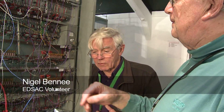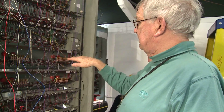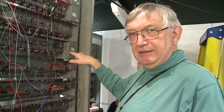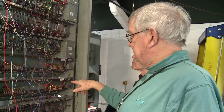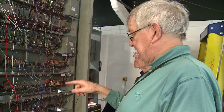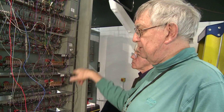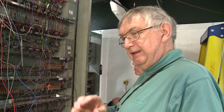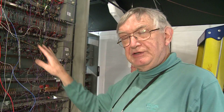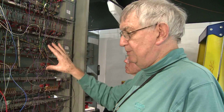This is a solution to a problem that's been going on for a while and it's now working really well. In this rack there's a storage unit and an arithmetic unit. The storage unit holds 18 bits in series and circulates all 18 bits round in a loop. The adder adds in an extra one every time round the loop, plus the carry from the previous clock. The net result is that as the information circulates it counts in binary up to a maximum of 2 to the 18th. That number then drives the whole addressing system and represents the position of information in time right across the whole system — so it's absolutely fundamental that this unit counts accurately and consistently.